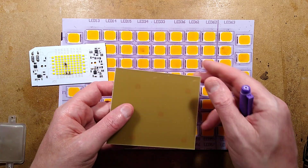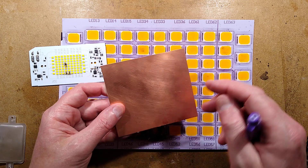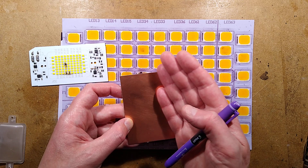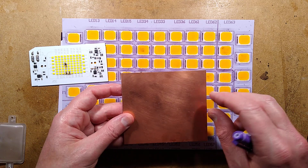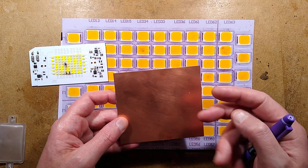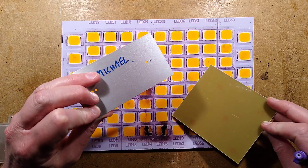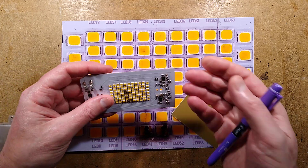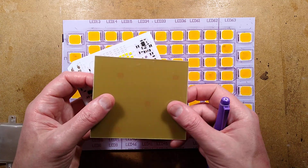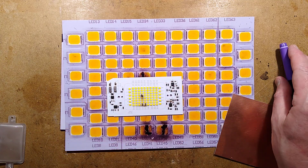This is a standard piece of circuit board material — a solid piece of fibreglass with a thin shim of copper on the surface. To make the circuit board, they photographically transfer an image, develop it, then etch it with ferric chloride or copper chloride, removing unwanted copper and leaving just the tracks needed, followed by drilling and silkscreen printing. With aluminium-core PCBs it's slightly different: the main bulk is a piece of aluminium for heat dissipation, with a super wafer-thin piece of fibreglass and then the copper on top.